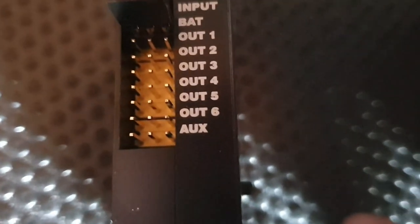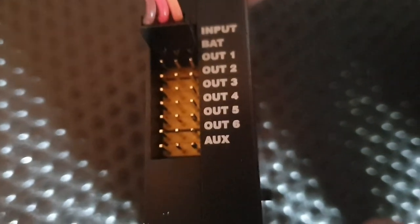And auxiliary — this is a special function which allows the Air Failsafe to connect to a smooth flight system that has a sequencer function on board. When it connects to the smooth flight system, the Air Failsafe will then trigger your main sequencer in the smooth flight, so your highly advanced nine channel sequencer in the smooth flight will get the failsafe functionality.